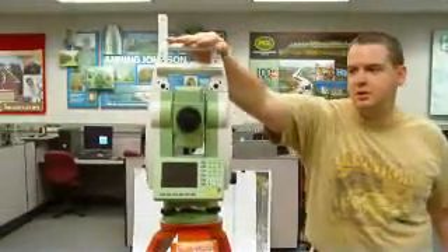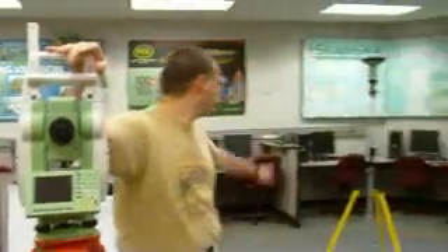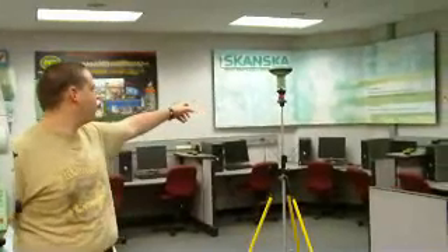It's a combination instrument. It uses the 1205 Robotic Total Station. The handle that's currently on it allows it to be the Smart Station. It also uses the Smart Pole, which is a combination 360 prism and GPS sensor.